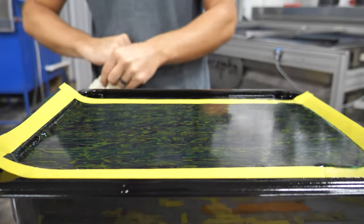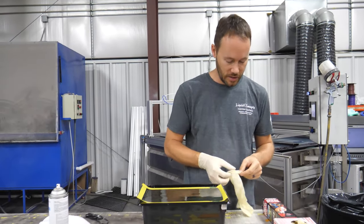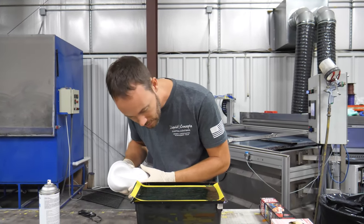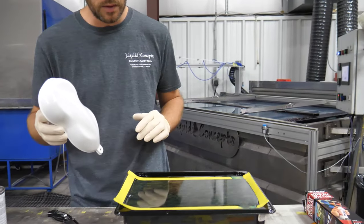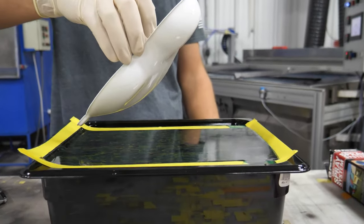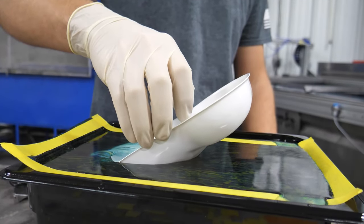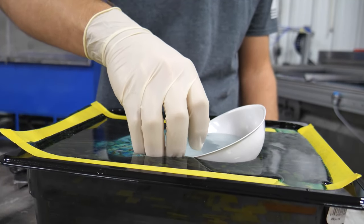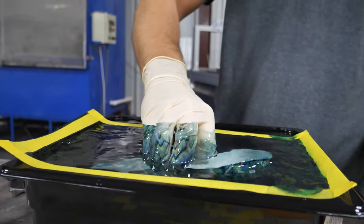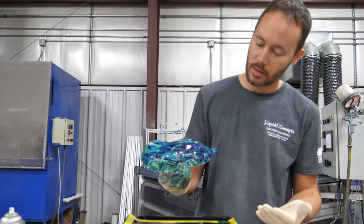You can see there's a very nice gloss look around the entire part. We'll put on some gloves — everything looks good, everything is glassed out, which is exactly what we want. Now we're going to take the part and dip it at a 45-degree angle right down into the water, going nice and slow all the way down.